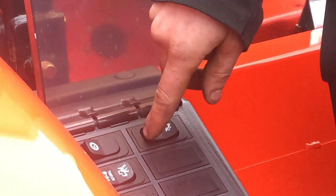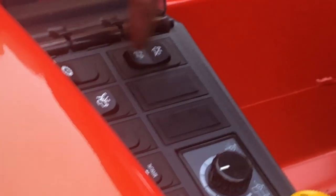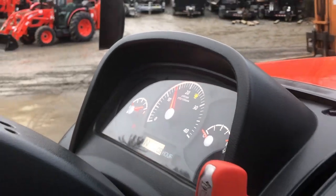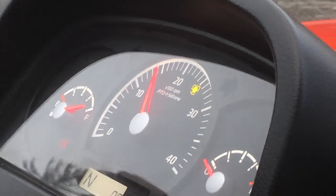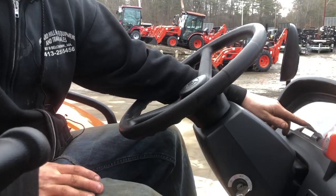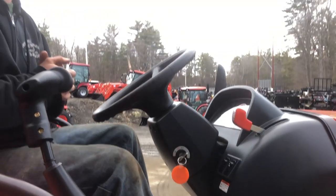This is the button you want to press — this is the parked regen button. I'm going to hold this side of the rocker switch down for a few seconds. You see the RPMs just bumped up to 1500. Since this tractor is new, there is no regen light because it doesn't have to regen. But essentially, this is a regen. If your tractor had particulate matter, you would see this symbol come on, probably flash, and then you would see the one with the thermometer.